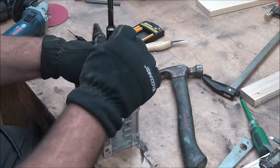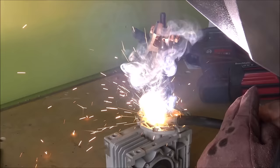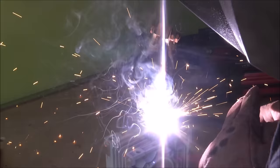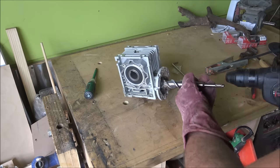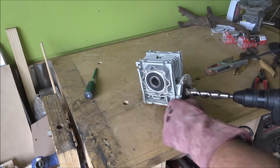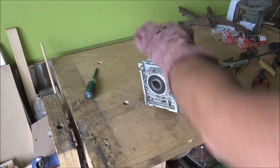I had to use a drill bit made for that drill, so I bought one that was bigger than the hole I needed, ground it down, and then I welded the drill bit into the drive side of the gear reduction system. This is kind of where I made my first mistake — and I made a lot of them on this. When I welded it, I thought I had it centered. I was not even close. There is a lot of wobble on that thing.